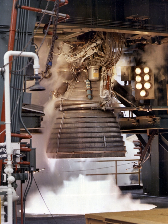One static and two dynamic seals in series prevented the turbopump oxidizer fluid and turbine gas from mixing. Hot gas entered the nozzles and the first-stage turbine wheel; after passing through, the gas was redirected by stator blades into the second-stage turbine wheel, then left through exhaust ducting, passed through the heat exchanger, and exhausted into the thrust chamber through a manifold. Power from the turbine was transmitted by a one-piece shaft to the pump, with the velocity of the LOX increased through the inducer and impeller before being discharged at high pressure.